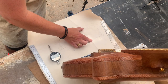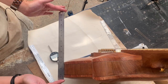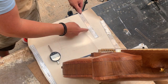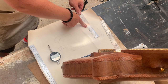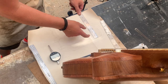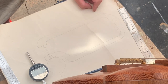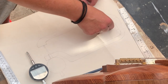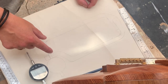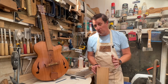I've also made it a lot deeper than the standard thickness gauges you can buy straight off the shelf. The width I need across that way is only about 4 inches — just short of 4 — but you're never going to carve a full guitar in one go; it's at least going to be split down the middle. One design feature I'm adding that isn't available off the shelf is a hinge, so a lot of them are just the same thickness all the way through, about an inch and a half. If you're going any deeper than that you're stuck because it doesn't open. I'm going to put a hinge on this so you can go around something to get that extra depth.